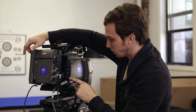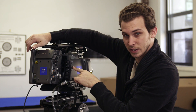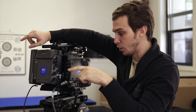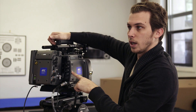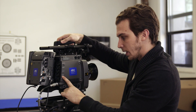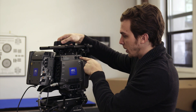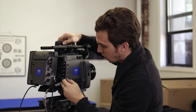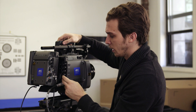On the camera interface here we have Genlock in, and we actually have a shutter sync — since we have a mechanical shutter, we want to be able to sync multiple camera shutters together so they are all spinning in unison. We have an HD luminance component output signal, a monitor out, SDI out giving us a 4:2:2 image with a second one up here, and also a remote for any RMB paint boxes or similar for independent control.